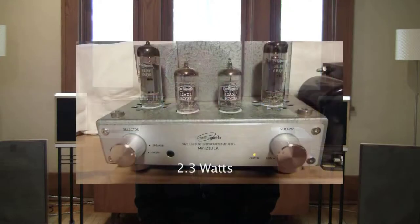Conversely, if your amplifier delivers less power than a loudspeaker requires, when the loudspeaker requires more power to handle a loud passage, the amplifier will go beyond its rated power and may start clipping the output signal going into the loudspeaker. This results in massive distortion which can destroy your loudspeakers. At either extreme, you can literally see your loudspeaker investment go up in smoke if you aren't careful.